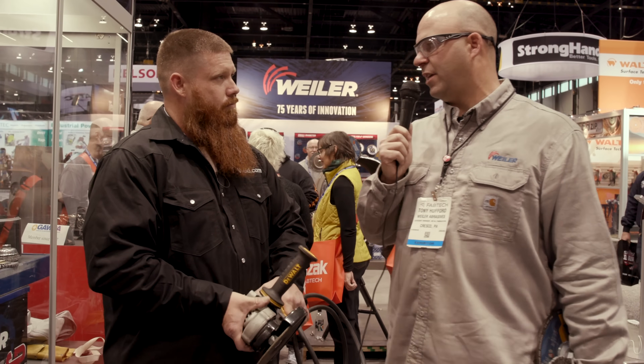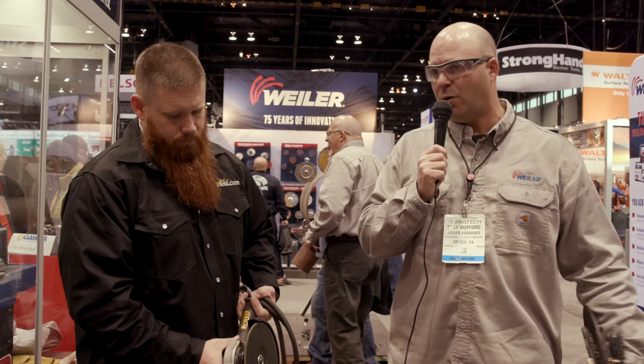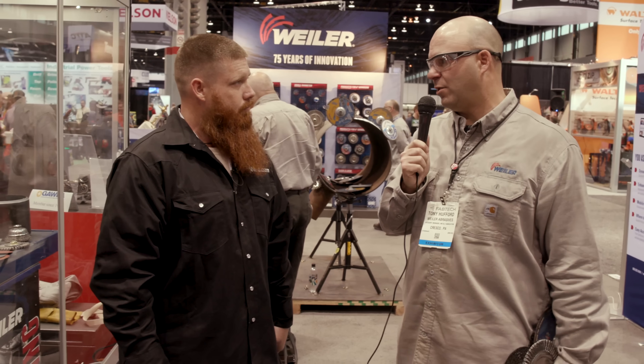It's also important — it's an eighth-inch wheel. Eighth-inch wheels are commonly called grinding wheels in any type of multi-pass application. A lot of people don't know what's in their eighth-inch wheel — it might have two layers of fiberglass holding it together, it might have three. This one has a special bond to allow you to use it like a wheel designed just for notching, but safe enough to use for facing the land and grinding the bevel. So it's got everything wrapped up into one wheel.